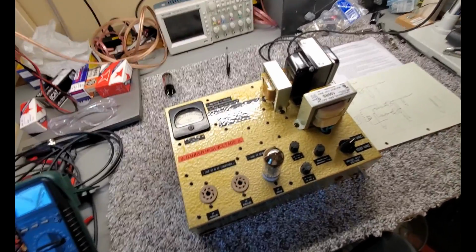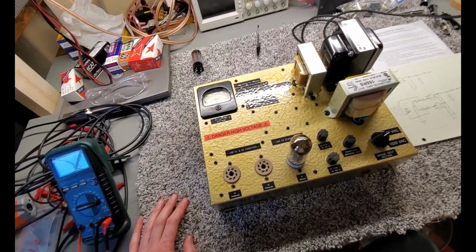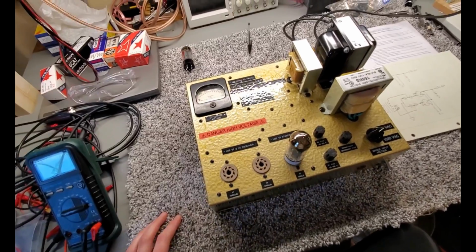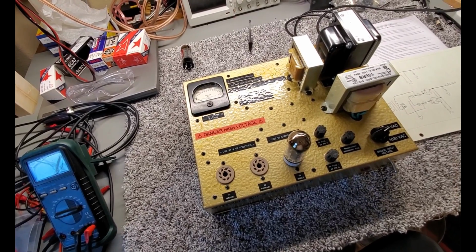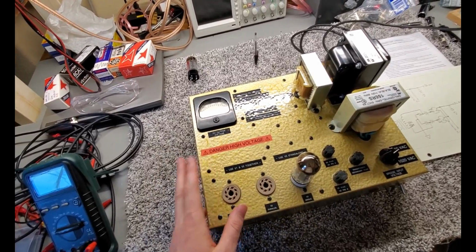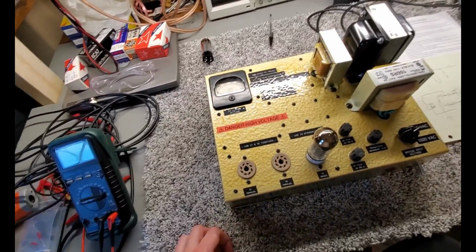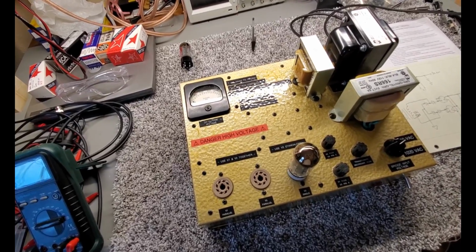But back to the bench, related to Project 2845, we've been seeing a lot of tube issues recently, both with some 845 tubes arcing, as well as rectifier tubes arcing in that amplifier. And not just that amplifier, in our other amplifiers we've been seeing some rectifier tube arcs. So it was time to build our own high voltage custom vacuum tube rectifier tester. This thing can test any of the 8-pin octal common audio rectifier tubes, or even non-common, and screen them prior to putting into an amplifier for issues with shorts.